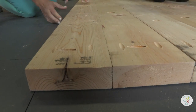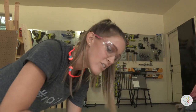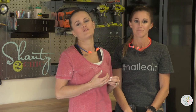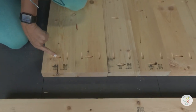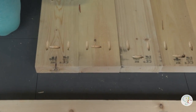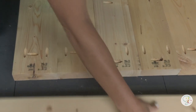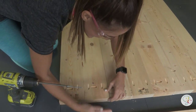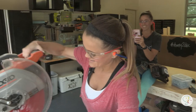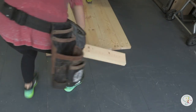You can see right here where we butt these two pieces together, we've got a super smooth seam that no crumbs are going to get stuck in. This is a kid-friendly table, which makes it a mom-friendly table. The pocket holes running this way attach the planks together, and the pocket holes running this way attach the breadboard. Once we've got the planks all put together, we'll measure and cut those breadboards to fit perfectly to size.